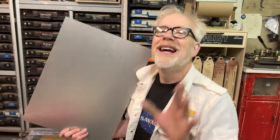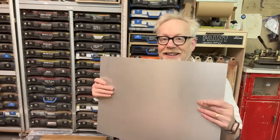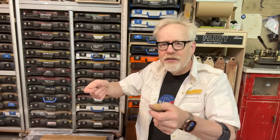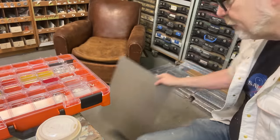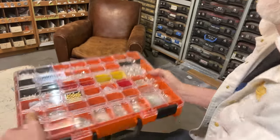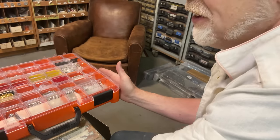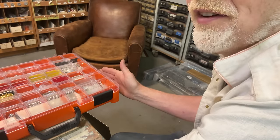Up till now, all my measurements have been theoretical, based on the critical measurements of these things on paper. Now it's the business end. Now it's incumbent on me to mark this out so that it fits the Sortimo, bend it into a shelf that gives me enough room that it's easy. I want to create a shelf where this guy slots in. First of all, you want to be able to plop it in, so it can't be super critical to the edges. I need like 1/4 inch of play space on either side.